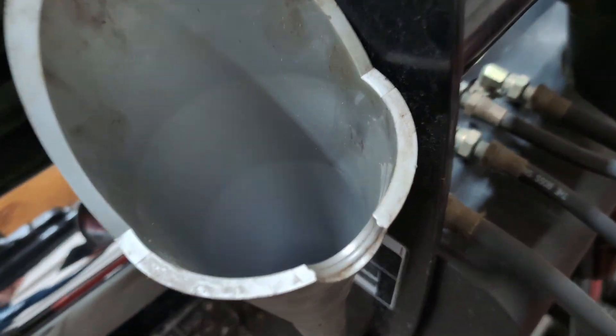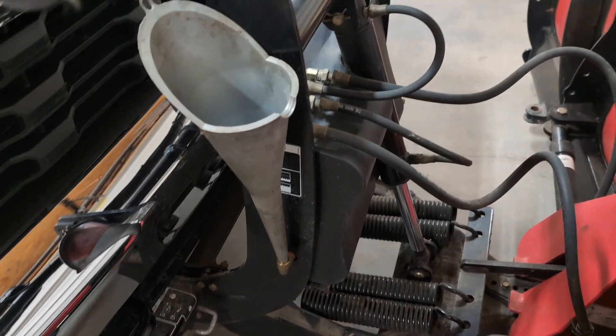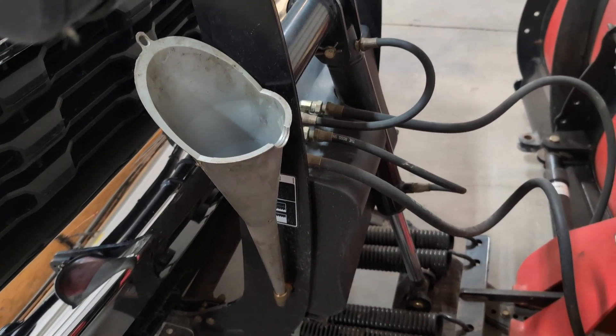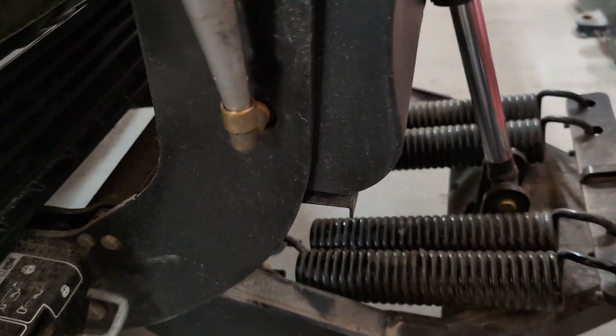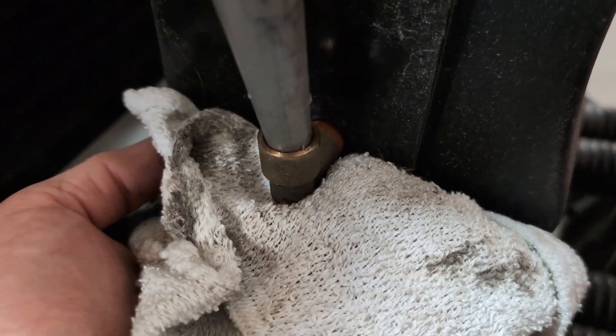So we slowly add the fluid. Wait until it goes down to add some more. Your typical Boss Snow Plow holds about two quarts of oil. On the side of the gallon, it has this little clear window — I put about two quarts in. So now we're going to pull the funnel and check it. This is where it's important to have the rag handy, because sometimes, if you've overfilled it, oil is going to spew out.